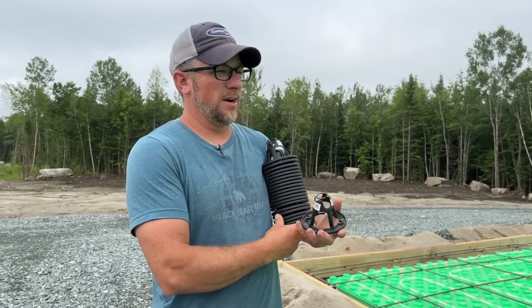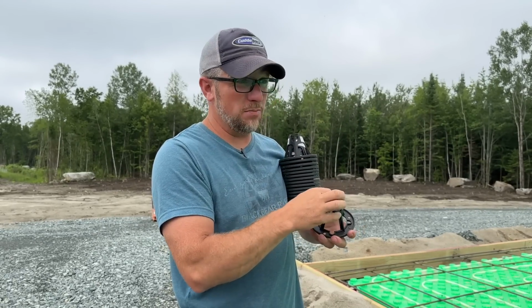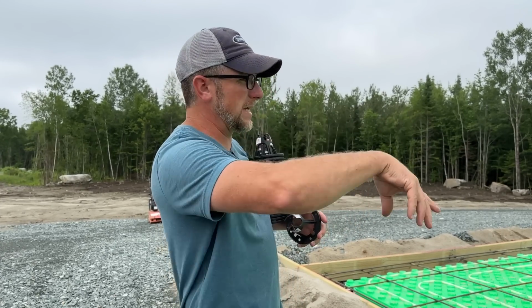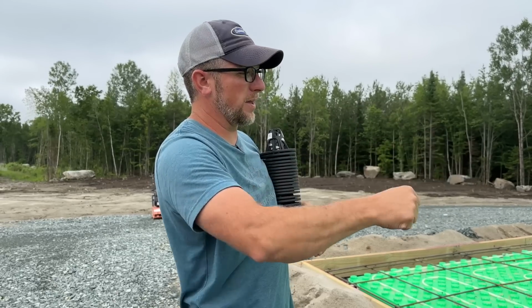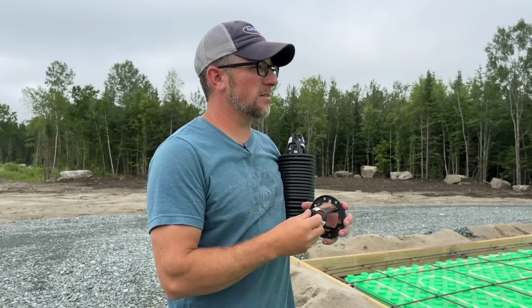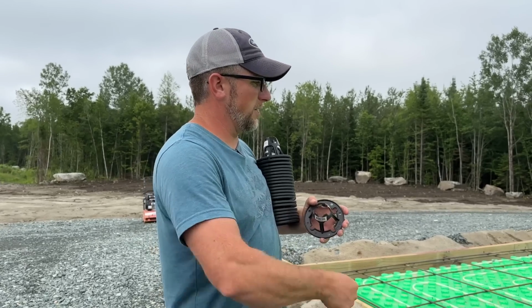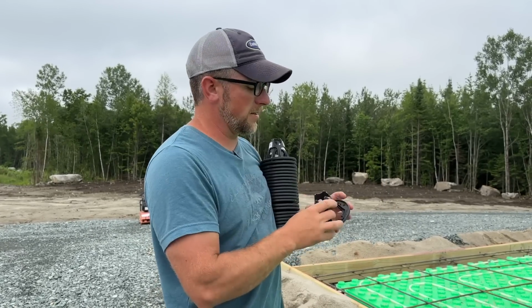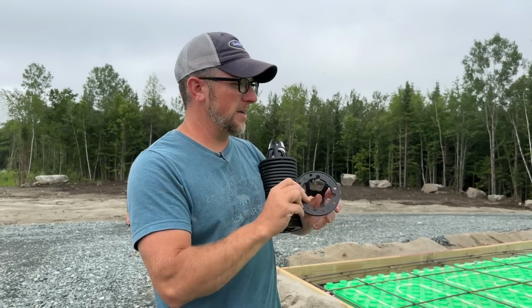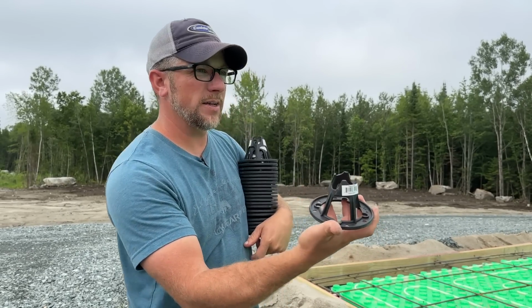A lot of people will either put like a brick under the rebar to hold it up. I think these are cheaper than doing that, and they kind of hold it a little bit more secure. Or other people will leave the rebar in place like this, and then when they pour it, they go around with like a metal hook, and then they pull it up and kind of try to get it into the center of the concrete. Personally, I don't want to do that with the PEX being in there, because if we grab a PEX hose, pull it up and just mess it all up, that would not be good. So I like these. We used these last time and they just kind of sit there nicely. They got a big enough opening where they sit around that little gear, so it'll keep that right where it needs to be.